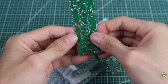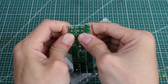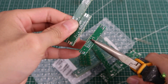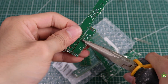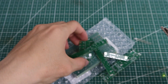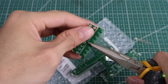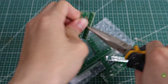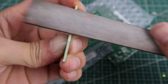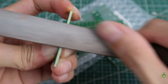This is the minimum setup, depending on your preference. You can increase the support for the bottom to increase the width, and the sub-boards for the left and right to increase the height. For the display I am making in this video, I added two more sub-boards for the bottom, making it 3x16 pixels in width and 8x1 pixel in height.